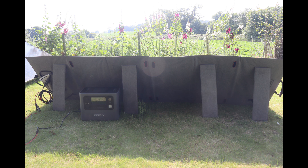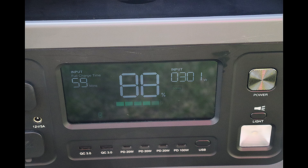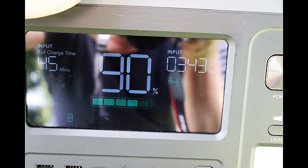There is about a meter to a meter and a half of cable length, so extension cables are something you'll likely need if you want to put the battery somewhere different from the solar panel. The first test was to angle the panel towards the east where the sun was, to get the optimal angle. At nine o'clock in the morning with the sun low, we're not going to expect maximum power — and we achieved over 300 watts. Not bad for nine o'clock in the morning. Leaving it an hour for the sun to get a little bit higher and stronger, we got 343 watts — fluctuating around 344, 345 — with some adjustment when cloud came over.